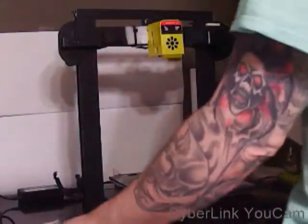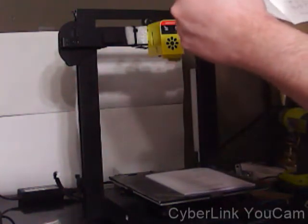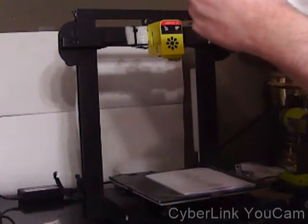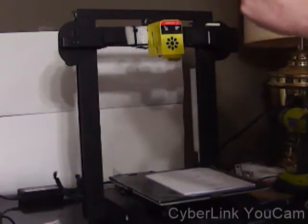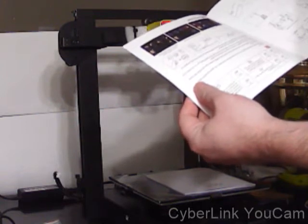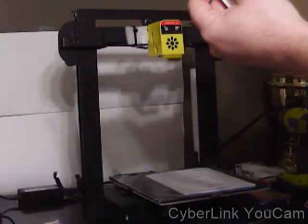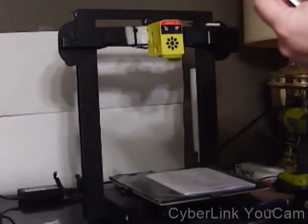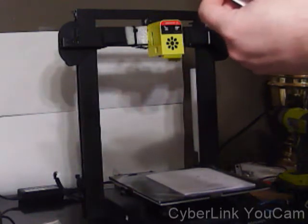FOKOOS. So, let me close my razor knife here just so I don't cut myself or anything like that. So, it says first to straighten the machine out and then fold up the gantry like I did. And it doesn't tell you exactly what to do. It just says straighten the machine, install the material rack, insert the FFC flexible flat cable, check if the screws at the extruder hotbed belt are loose, tighten them, nut on the pulley under the extruder.